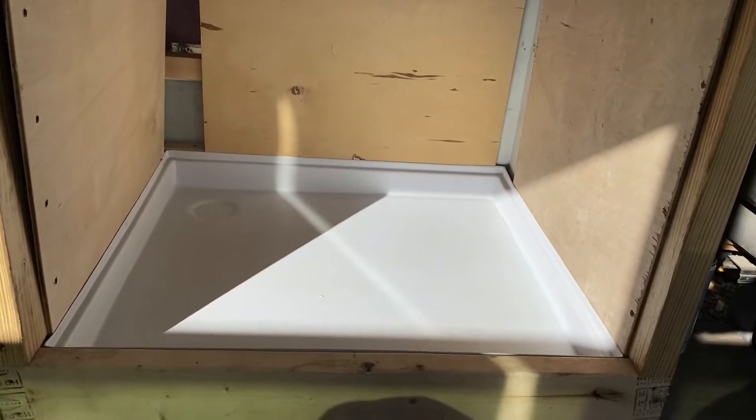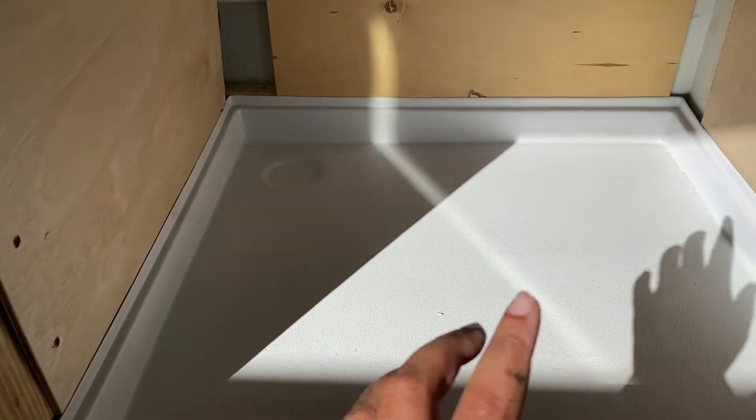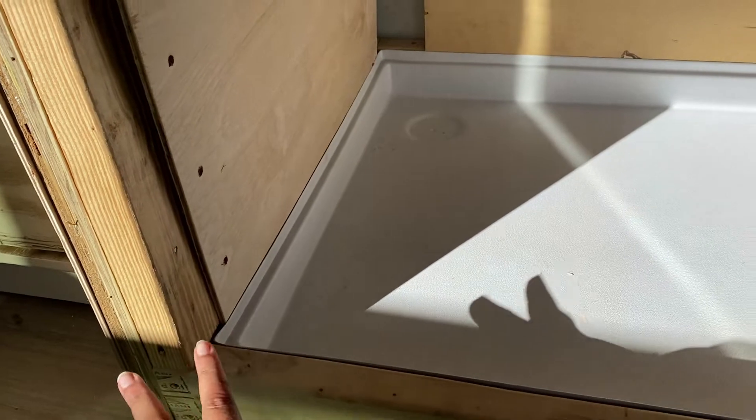Okay, so the pan is in the shower. It looks like we have plenty of room to put the quarter-inch on the sides. There's a gap up here but it's not pushing forward anymore. If it's pushed forward as much as possible, it doesn't look like we have a gap back here. My scrap pieces of wood are all touching the bottom of the floor so they do fit. The only concern is it's kind of pushing against the pan a little bit. Over here it's fine — not bending, it could literally go all the way down. But over here I kind of stopped it because it started to curve. And for the back it was a very tight squeeze, but I did manage to get it in there.